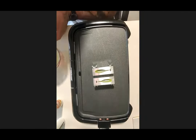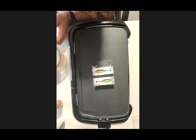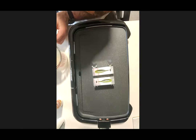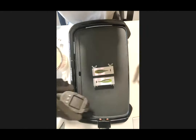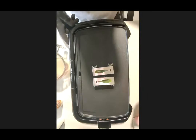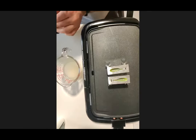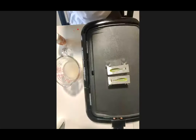We also have a question. Can you mix colors to make different colors? Yes, so the primary color scale would come into play. Yellow and blue will make green, that sort of thing. And some clarification: it's setting up on the heat plate? So this is currently on the hot plate, keeping at a temperature of 330 degrees. It's also keeping the mold and that first layer of plastic we poured hot. If we didn't, I would have to hit it with the heat gun to get it more to a liquid state before I poured the second layer.